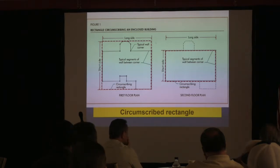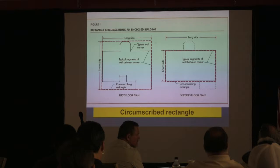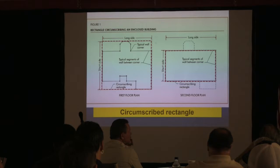Yeah, Bill. Question for you. Work with me on the stucco homes. A lot of times the hard coats are all just an insulator board on the field studs. There's only bracing on the corners. Good point. Okay, so you're not complying with fully qualified sheathing. What Bill's saying is that on a lot of hard coat stucco applications, they're only using OSB on corners and intervals, so it's intermediate bracing, because they're using an insulator board as the filler material in between to apply the screed. The hard coats can go over open framing. They don't even have to have a sheet.